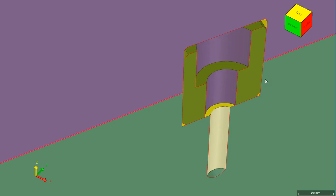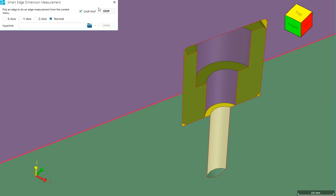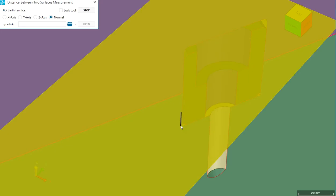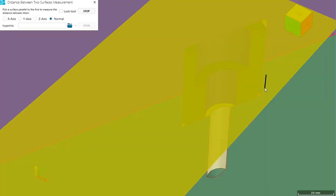We have so many stations and each station has different thrusts. To counter the thrust, apart from the four guide pins, we provide heel blocks. Heel blocks will be in the upper die; in the lower die we will have wear plates. All three wear plates are fixed on a holder, and that holder is pocketed, bolted, keyed, and in some cases — as per customer standard — welded to the lower plates.